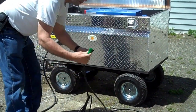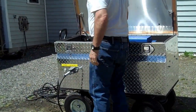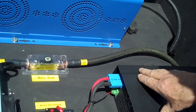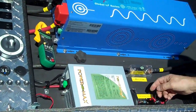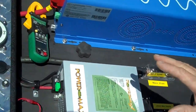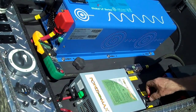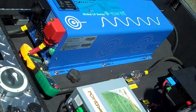It simply plugs into these connectors — there's no way of getting it wrong. Now, with these solar charge controllers, you never want to put solar power onto them without them being connected to the batteries first, because the voltage spikes and it can damage them inside. This particular model has a system that prevents that from happening. So we'll turn on the breaker and connect that to the battery bank. You probably can't hear it because the wind's blowing, but there's a relay that after about 30 seconds clicks. The relay just clicked — so now, at this point, we've shut this breaker and right now we're feeding power from the solar panels into the unit.